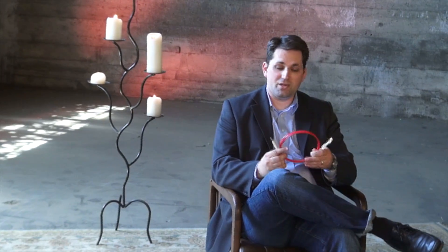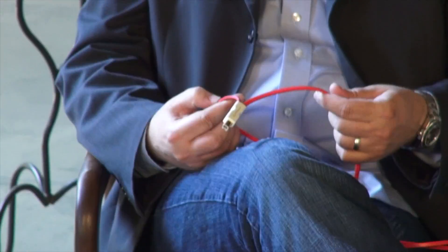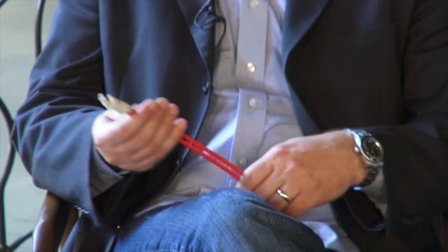Second, we found that noise from the server's power supply traveling down the power leg of the cable confused the signal, injecting jitter into the whole system. To fix this, we physically separated the power leg of the cable from the signal.